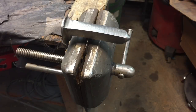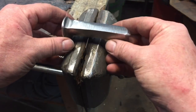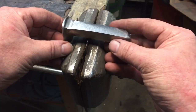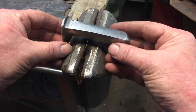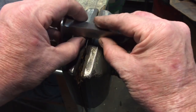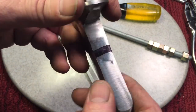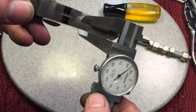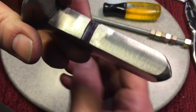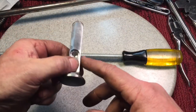To get the proper balance on where you're going to drill the hole for the handle, I take a blade, put it into the vise, and balance the spike on it until you get to that point where it's perfectly balanced — that's where you know to put the hole for the handle. Once you have your balance point, mark it with a black marker. Take your calipers, get the approximate center, scribe it this way, turn it around and scribe it again — it leaves two marks. Put your punch right between those two marks, and that'll be the center.